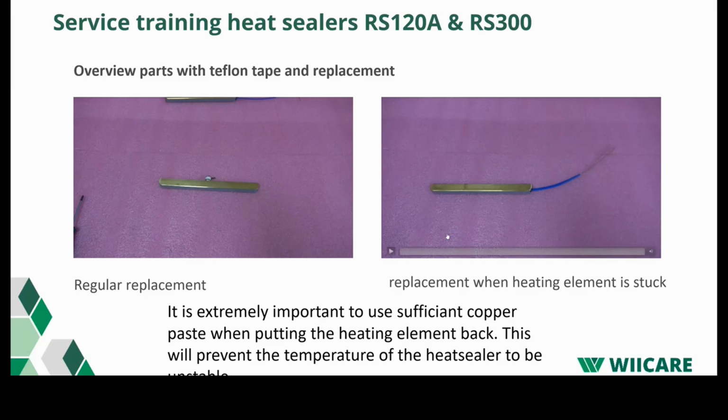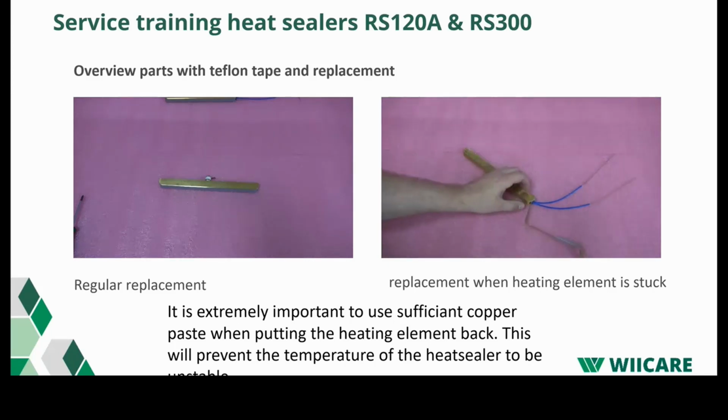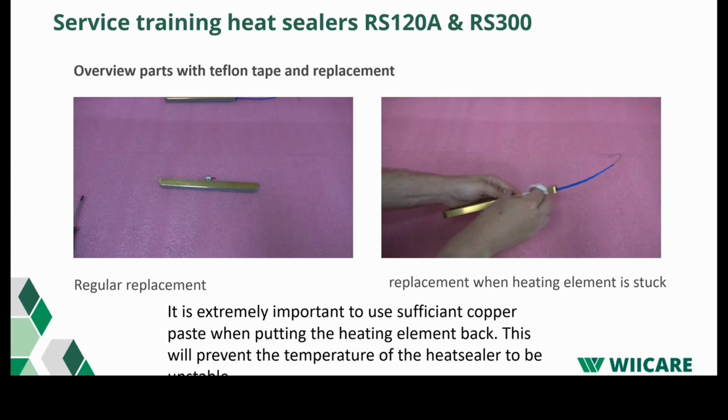And now the next video will show you how to replace it when the heating element is still stuck in the bar. In case you got a heating element that you cannot remove, you can do the following. Remove the old tape. And clean the surface with a degreaser. Apply the new tape.